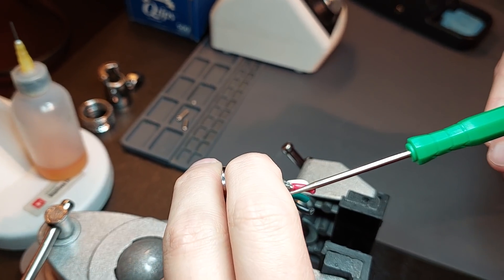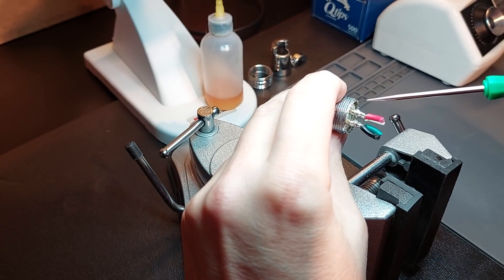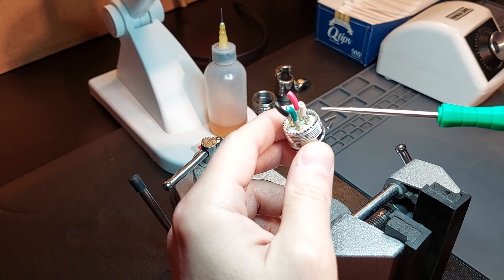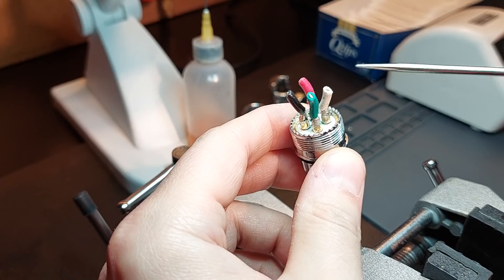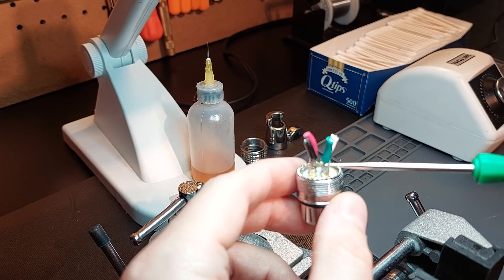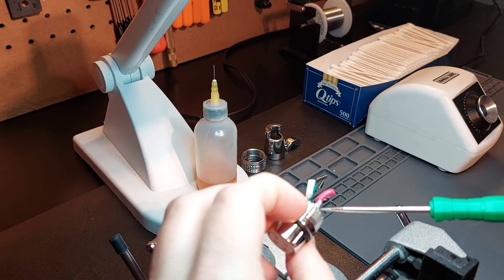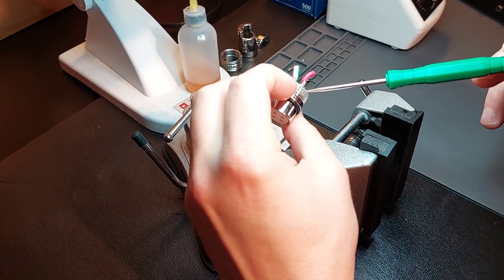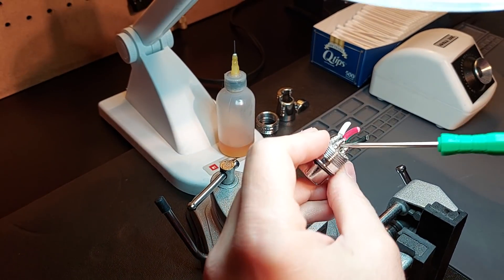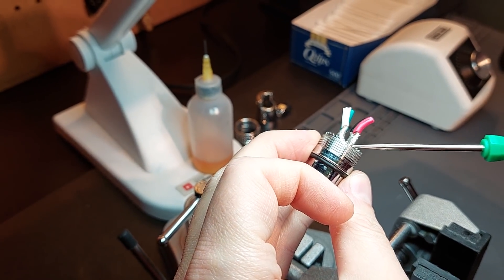We also see conductors penetrating the actual solder, and again this is a three-phase cable. I would highly recommend being very careful with this. If your connectors look like this, they are technically connected — which is something that always gets brought to my attention online. Yes, they are connected, but these can lead to issues, especially with that gap, because that's not a full conductor making a full weld all the way through the cup. We don't know how much solder has penetrated into those cups, but if the solder was fully in the cups, you wouldn't see gaps like this.